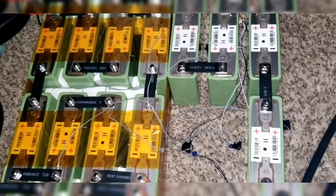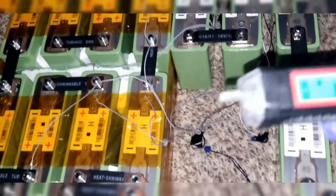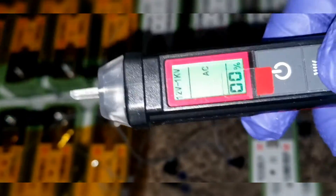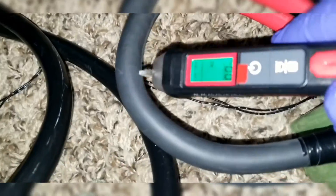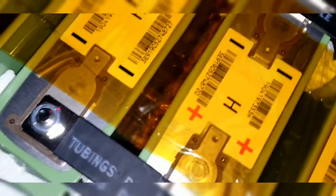Let's go try it on the batteries. These are some of our DIY battery packs we built here with the off-grid solar system at JW Solar USA. Now we have this detector — can it tell us that these batteries have power on them? They're at around 70 volts, so we're going to change it to the 12-volt mode by clicking once. Go around here — it tells us this battery is live. They're all live. Even this wire is live, because it reads from 12 volts to 70 volts and up to 1 kilovolt. So it tells us these are all active.